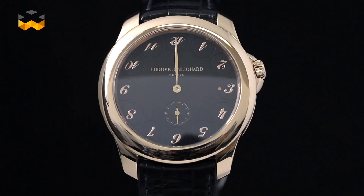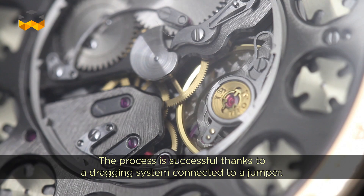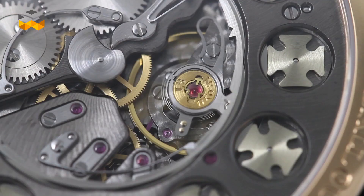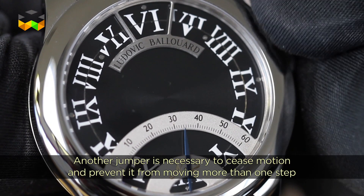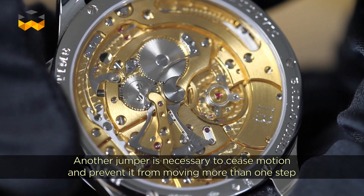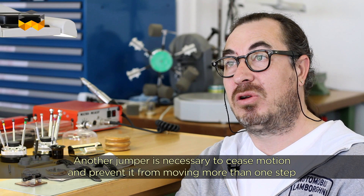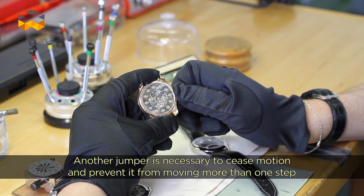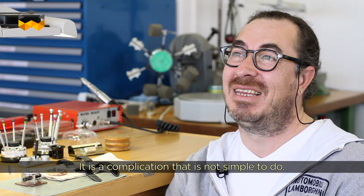It's like a bow: at the start, you pull the arrow and it's easy, but the further you draw, the harder it gets. For the triggering, there is a trailing system that rotates as the spring arms, with a detent. At the moment of release — click — it passes the detent, launches, and releases the energy. When the system is set in motion, there is an inertia, and another detent must stop the system at the end of its travel. During the arming phase, this second detent is disengaged so it doesn't hold back the jump. Then it releases, lets the system fly, falls back, and stops it.